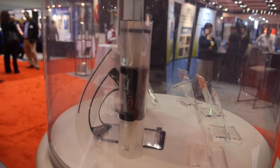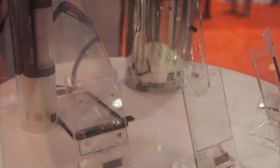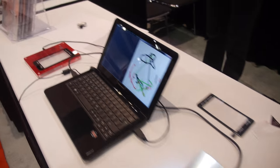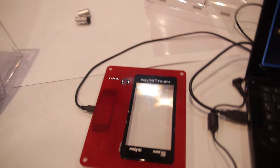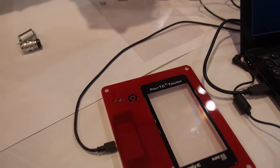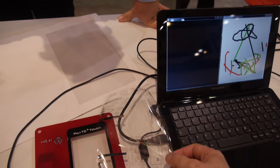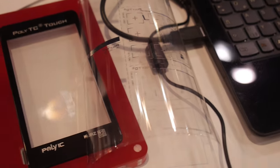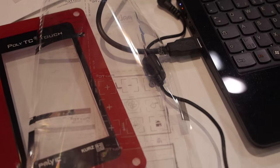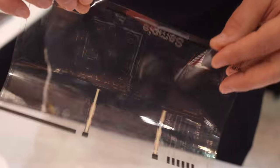This is called metal mesh in the industry, as a substitute for the standard ITO sensor. So it's in the area of non-ITO sensors, like graphene, silver nanowire, or carbon nanotubes. Are you the leader in metal mesh? I wouldn't say that. Let's say we're one of the first ones, and it's growing fast. The advantage of metal mesh sensors, also from competitors, is really the high conductivity of the metal lines. So there you have a great sensing quality and performance.